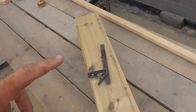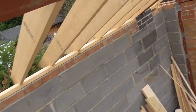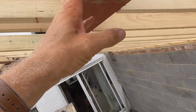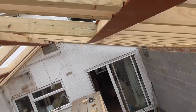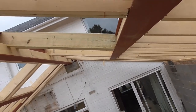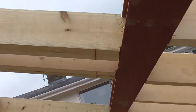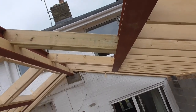I've cut these trimmers that finish off making up the opening for these Veluxes, and I just thought I'd quickly show you what I've done just to keep them all in a nice straight line. This steel did actually end up with a slight bow on it — like I said, structural steel, not the end of the world. So rather than put the windows in measuring off this beam, which would mean the windows follow the bow and be slightly out of line, what I've actually done is taken my measurement each end and then pinged a chalk line all the way through. That means all those windows will line up perfectly, all the reveals will look lovely and straight. It's a little tip — when you've got one Velux it doesn't really matter, but with two or three it's nice to get them in line. So I can get on and stick those trimmers in now.